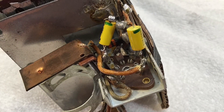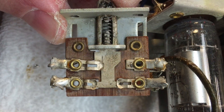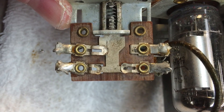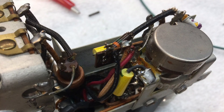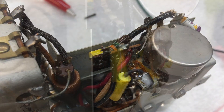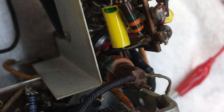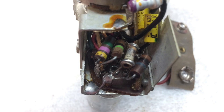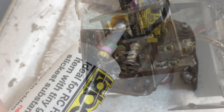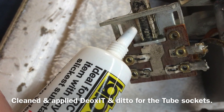The chassis being so small, it was really impossible to show the work along the way. I could barely get my fingers and hands in there to get the capacitors in. In a few cases I actually melted some of the capacitors with my soldering iron trying to work in those tight spots. But I got all the caps replaced, except for the picofarad caps that all checked within 10% — left those in place — and then only a handful of the resistors needed to be replaced. There were a couple I left in that just tipped over the plus 20 percentile, but I'd like to leave those for now. You can see a little grease there on the slide switch, getting it ready to be mounted back into the chassis.